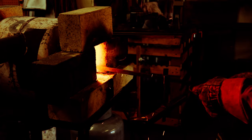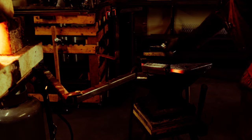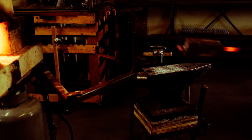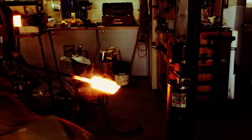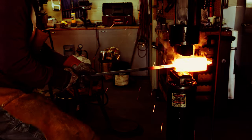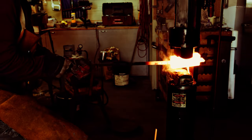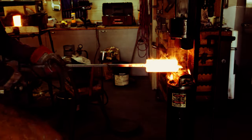Let's get going on the first forge welding operation. I will get the billet up to about 2400 degrees Fahrenheit, coat it with anhydrous borax to help dissolve scale, and then weld it gently on the power hammer. You can see the super hot flux spraying away on the hammerheads. Tiny holes in my shirt bear witness to how hot they are. There are also quite a few tiny scars on my skin where larger pieces manage to get stuck.